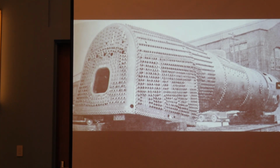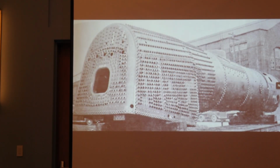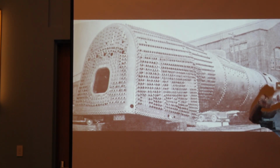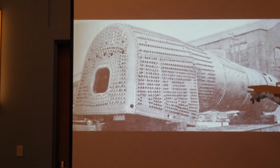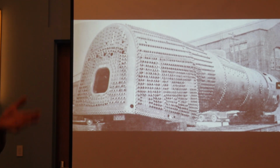All right, now, unstayed areas. And again, unstayed areas, there's no other means of support. An unstayed area is something that supports itself. So this is just the smoke box, that doesn't matter. But from here back up to this is a combustion chamber. That's for what it's worth, anybody wants to know. That's an L2, New York Central L2 Mohawk boiler. So there's a combustion chamber up to here. But basically, this part here, the whole way to here, is self-supported. If something happens there, there's no other way to keep it from having a problem. You don't have anything backing it up.